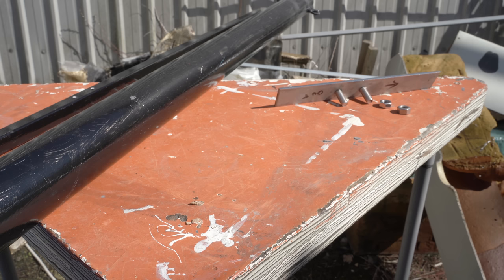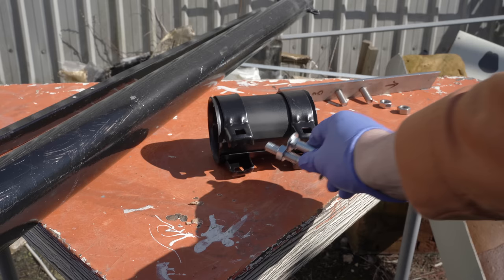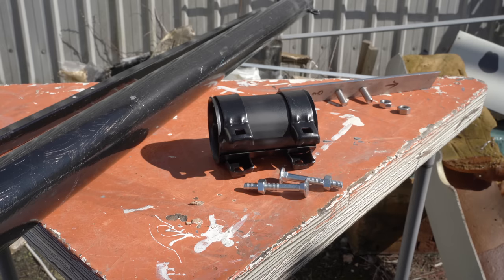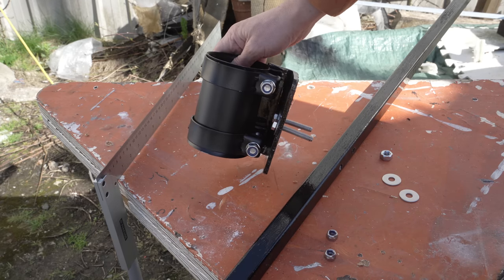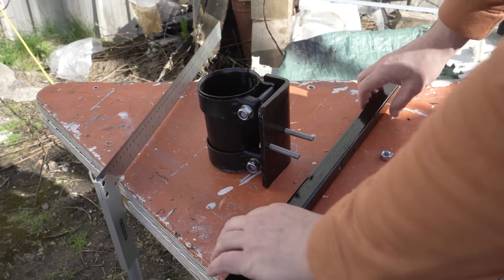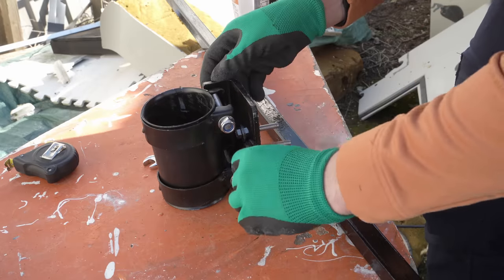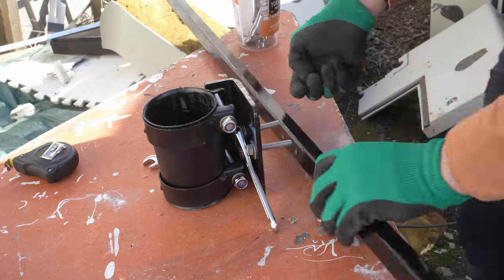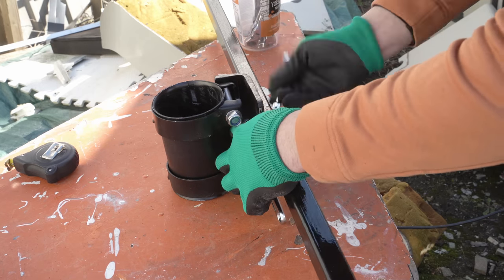We're putting the mast collar and assorted gubbins together like an IKEA kit. The bolts the stainless collar came with were zinc coated, almost like the supplier was begging for them to corrode, so they're swapped out with stainless ones more similar to the collar body. The box section crossbeam is glass fibre, with very much the characteristics you'd expect. A little more flex compared to if it was steel, but much lighter and with no electrical conduction issues.